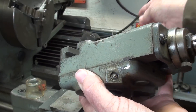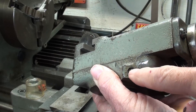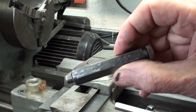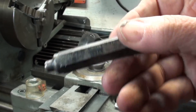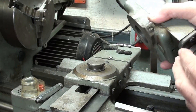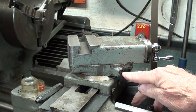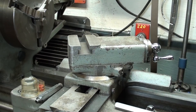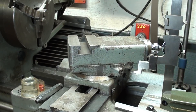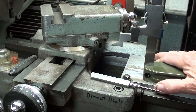What I've done here is to take out the pins and the screws — you Atlas people know what I'm talking about — and I put in a 3/8-16 transfer screw. Assembling this temporarily, just by gravity, I am going to try to locate the center of this, which will not be too difficult, because I'm going to slide up this rather nice piece of aluminum that just happens to fit, by providence.